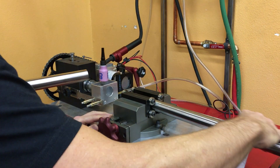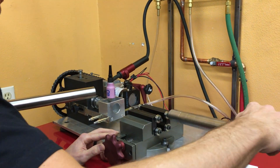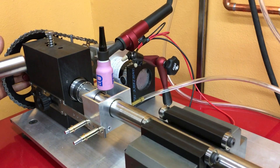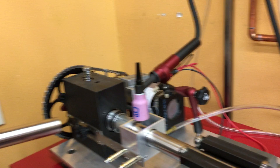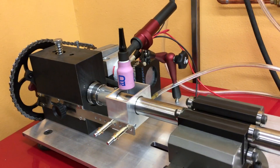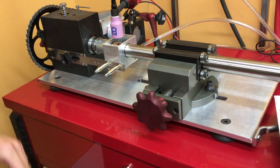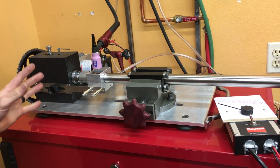Here's our seat tube that's been purging with some argon gas for a little while. Now we just slide it in here to the centering vise, line it up, and into our collet. Tighten up the centering vise, and now we need to wait about a minute, minute and a half, so I can tell you about the machine.